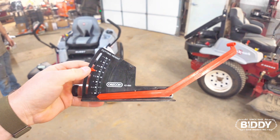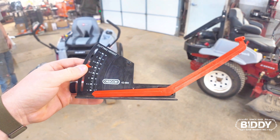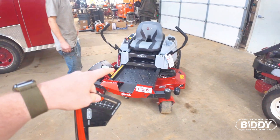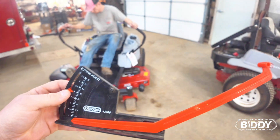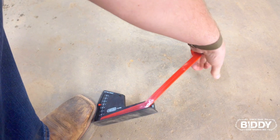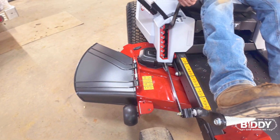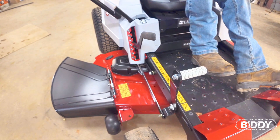On these Quests it is a little more difficult, but we're going to show you the process of how to do that. So here we've got our deck level — we always want to level our decks. Each dealer does it differently, but we try and always level each one of them on three. So you'll set the deck height on the mower to three, come here, put your deck level on three, and it actually hits the blade. Put that on the blade and it will move up and show you what inch it's at. Alright Chance, go ahead and drop that deck down to three.